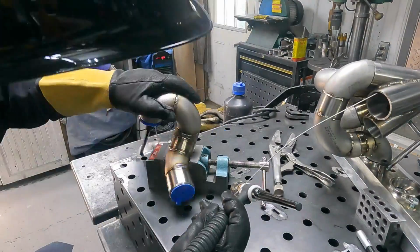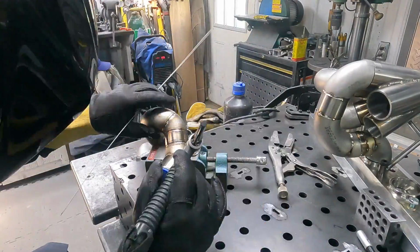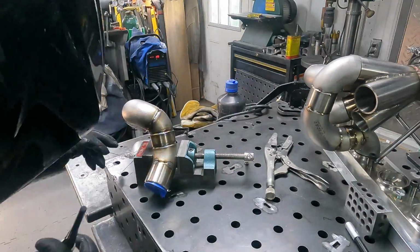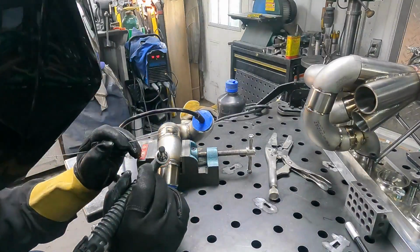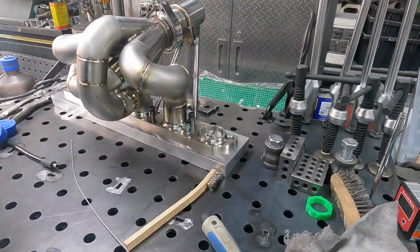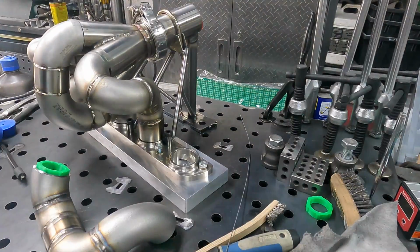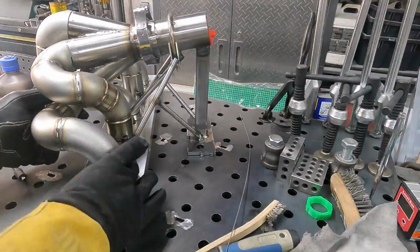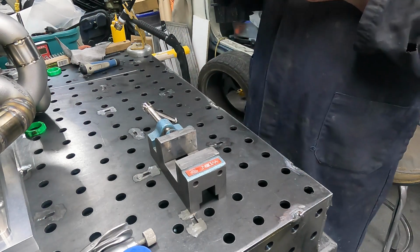So anyway, here we are, just fusing that root in again. Whenever I've got that filler wire in my hand, it's just on the off chance that I'm actually looking to keyhole that fused joint right at the bottom just a little bit, right? It's a delicate dance with the keyhole there, just trying to get it to flood through so you know you're getting it fully penetrated. But if you don't get it fully penetrated, you've got to dab a little wire in there.